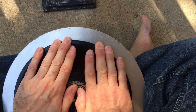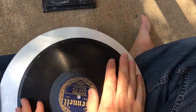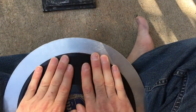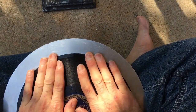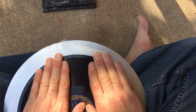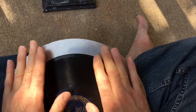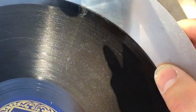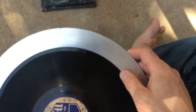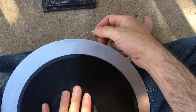What I do is work around the perimeter, pushing down and forcing it — it's almost like a massage. That's why it's important that this metal plate be polished and rather stiff, otherwise we would bend the plate and the record in the process. It needs to be polished because, with the amount of force I'm pushing down with, it would put impressions of whatever's on the plate onto the disc. With the third session done, you can see the crack is almost perfectly closed. Once it cools it may open up again, and I suspect probably one more session will be in order.